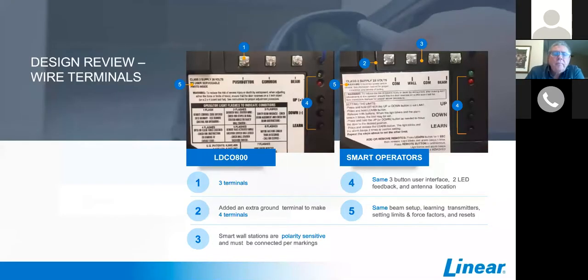As you can see, there's 1 to 6 flashes on the 800, and down right on the bottom of the left, you'll see 7 flashes covered up. That's basically a way you can override the total machine. If you've got issues in the marketplace, doors acting weird, not working right, gone into a 7 flash, it doesn't mean the board's bad, doesn't mean the opener's broken. It just means it needs to be reflashed to factory default and start over.